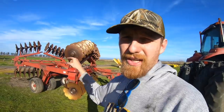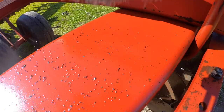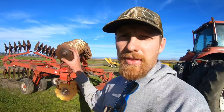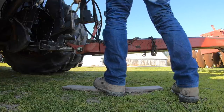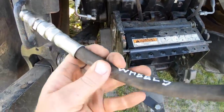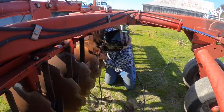One thing we found: three seals on the hydraulic rams here are leaking. You can tell because you can see the hydraulic oil and even dead bugs stuck in the hydraulic oil that's dripped down. This bad boy had seven cracks on it and three seals leaking on the hydraulic rams which lower and raise the wings. Of course, we had to unhook the tractor and take off the hydraulic lines before welding, because if we didn't, the electricity could fry the computers inside the cab.